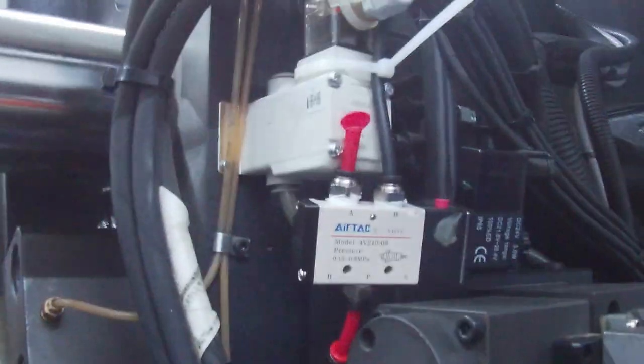The actual air connection for this machine is right there, but it's all metric, 10 millimeter push to connect tubing. And in the US, I've got 3/8 push to connect or 1/4 inch, which is 9.5 millimeters, and it just doesn't go in. So I had to hot wire it a bit with my own valve, that guy right there, with of course the quality zip tie. Anyway, I digress. So let's turn on our new cooling system and see what happens.